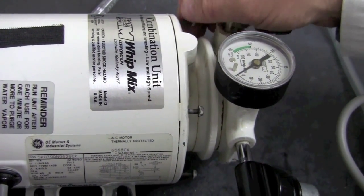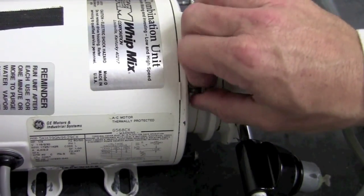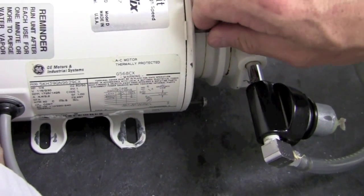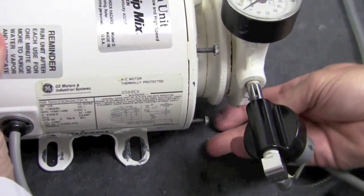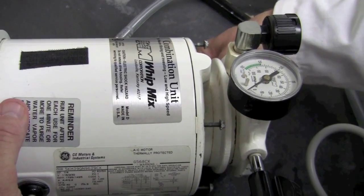It's important to note that I've completely loosened the four through bolts, but I have not completely taken them out of the motor. Taking them out will result in it being a lot harder to reinsert them later when we reinstall the lower housing. Just loosening the bolts is sufficient for the procedures we're going to be accomplishing today.